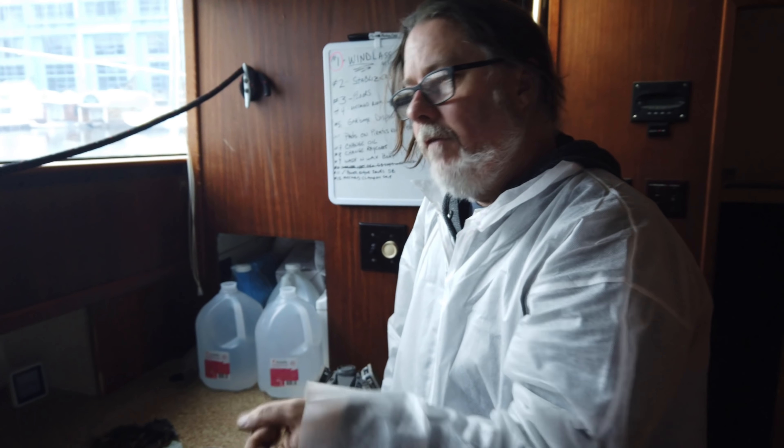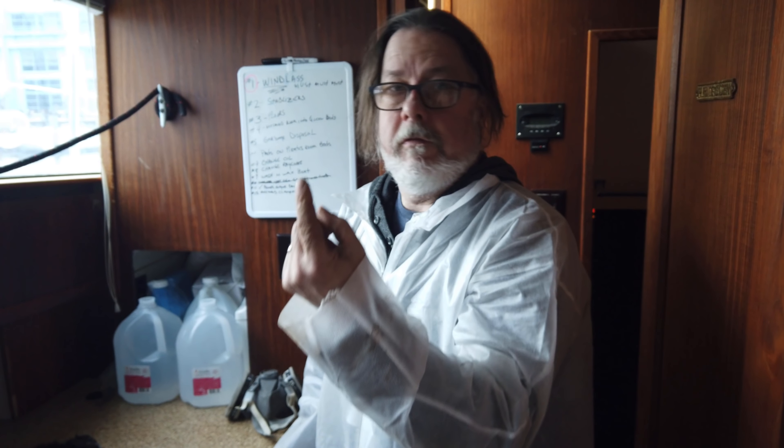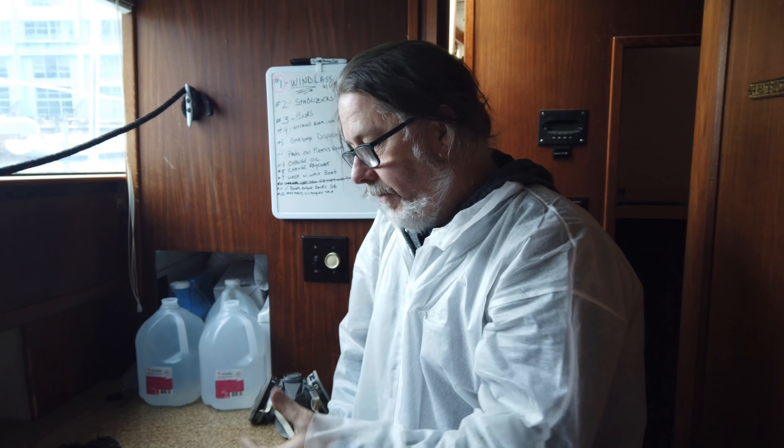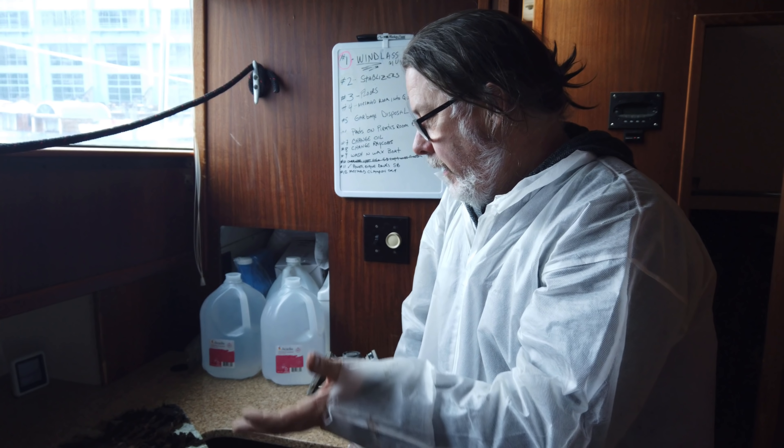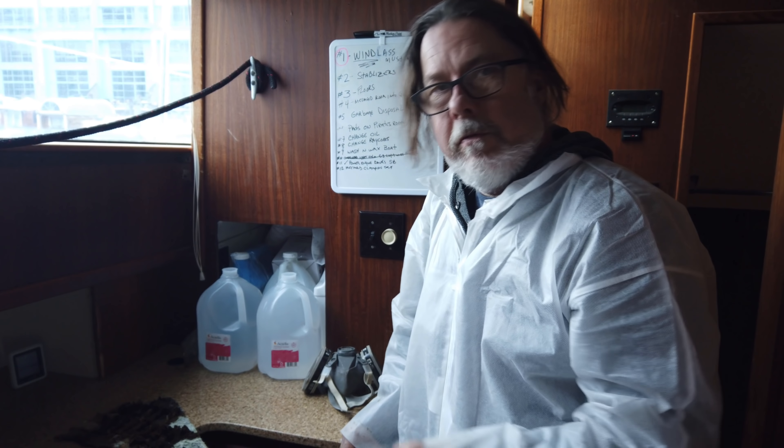Anything I don't get — if I find another problem area — I can always do it from the top. This is what's underneath the pulpit. I don't think there's any delamination or anything that feels bad outside that pulpit area, so I'm pretty sure all the damage was limited to here. But I'll know once I get in there, scrape a little bit more, dry it out, and go from there.